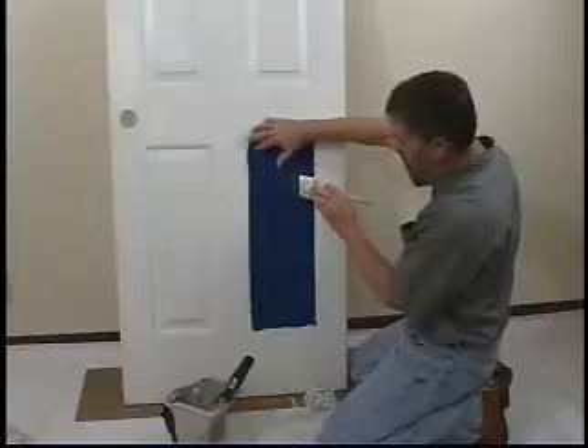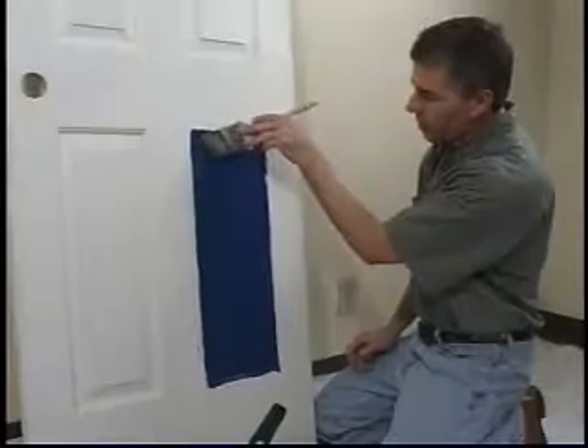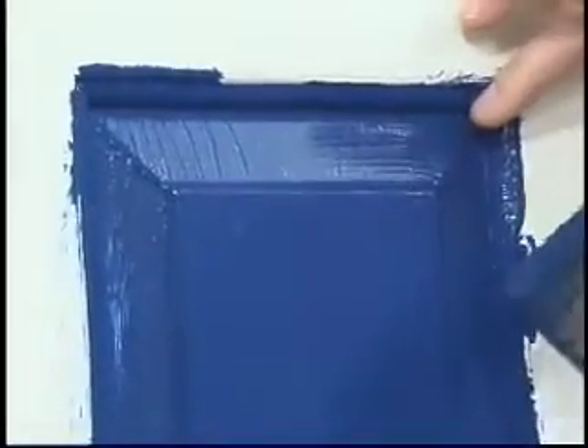Now typically this area in the corner, there's a little raised panel here, so we want to be careful that our brush — we don't pull it hard over the edge and get a run, which we typically see on the door. So we're going to match this angle of the brush with this angle in the panel and just pull the brush over and smooth.